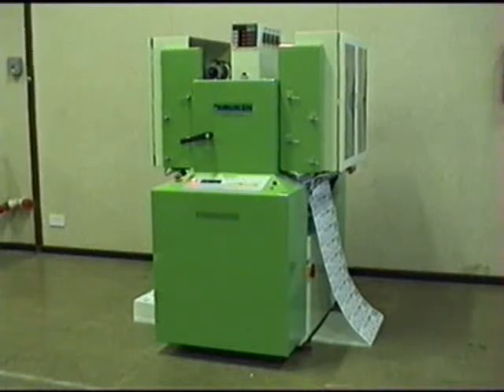It is possible to program up to 9 individual foiling steps in 1 foot depth. With an easy release foil on a 3-inch depth ticket, the machine is guaranteed to foil at 10,000 impressions per hour with a registered image hologram and 12,000 impressions an hour with a wallpaper hologram.